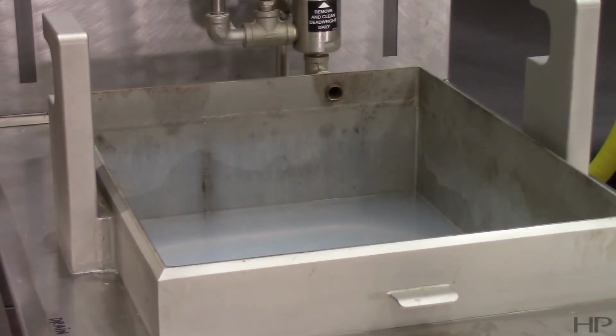A word of caution: do not close the lid at any point during the clean-out procedure. Water under pressure becomes superheated, and when the lid is opened, escaping water and steam will result in severe burns. Watch the cleaning solution constantly to make sure it does not boil over, causing damage to controls. Do not use steel wool or other abrasive cleaners, or sanitizers containing chlorine, bromine, iodine, or ammonia chemicals, as these will deteriorate the stainless steel material and shorten the life of the unit. Lastly, do not use a water jet or pressure sprayer to clean the unit, or component failure could result.